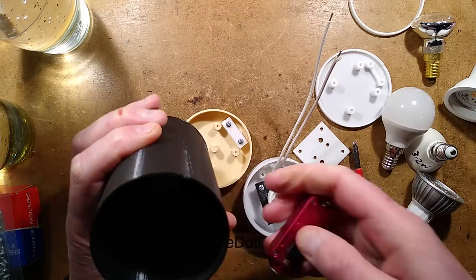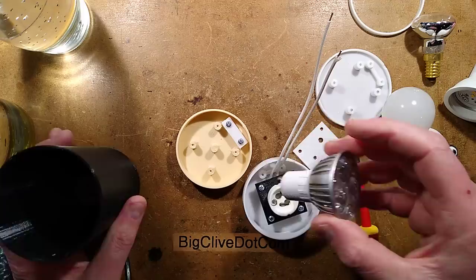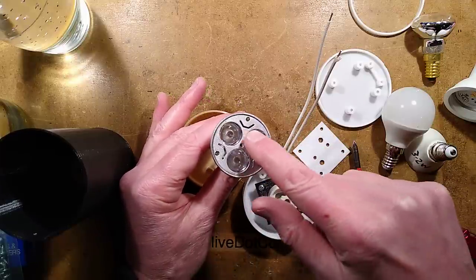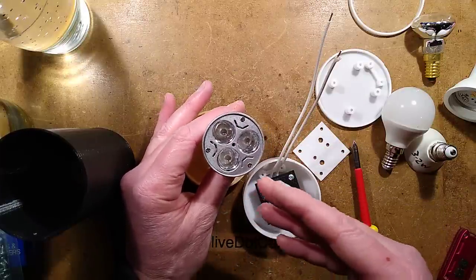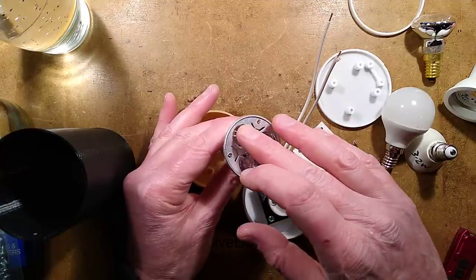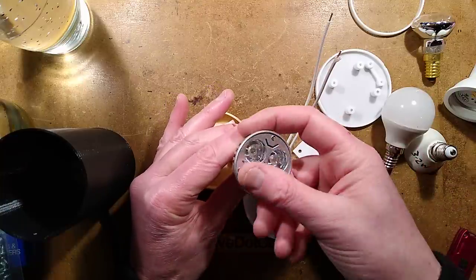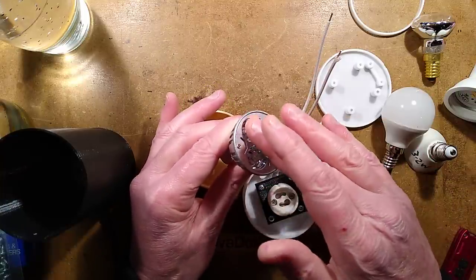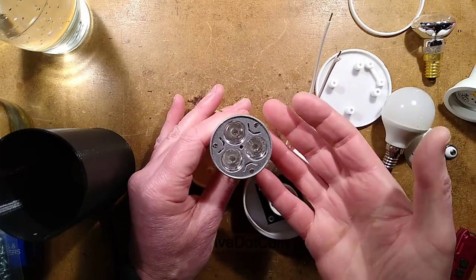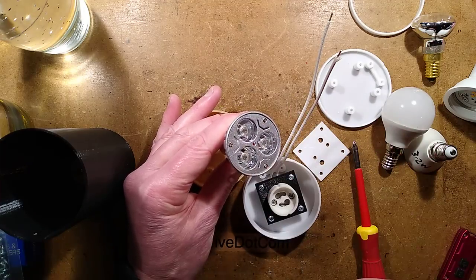Pulls the cable relatively firmly, but not dragging it out. Once you've done that, you then have to fumble down inside with your lamp. And note that with these ones, you can get a couple of different effects. With this classic style of lamp, you can remove the front cover and the lenses, but note that the little circuit board behind is usually not glued on. It's usually held in place by these lenses, these total internal reflection type light guides. Note that the majority of these lamps I get, they're loose and rattly, which means they're not pressing down too far. But if you have the bare chips, it will give quite a sparkly effect. It will give a different effect to if you've got the focusing lenses on the front of it.